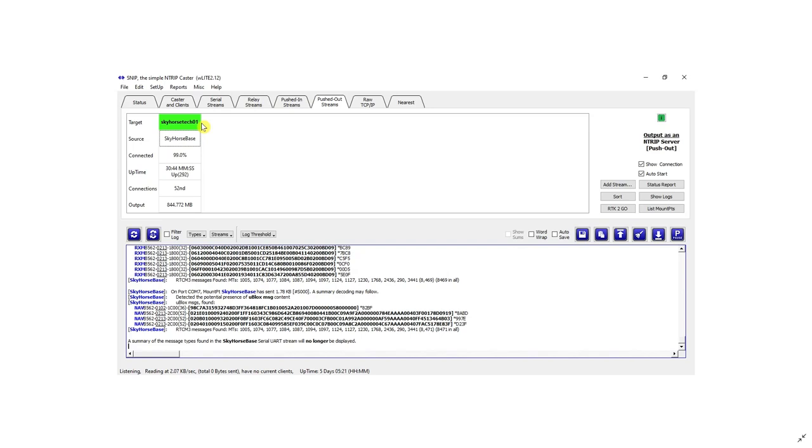Now we can also have other options here of reading back our NMEA messages if we wanted to. You get up to 3 ports for free, so you could theoretically read in from serial, push out to your mount point, and then read back if you needed to. In our case, we're using a third-party app on our Rover side, so we can read that information and those corrections and log them there, so we don't need to do that here.